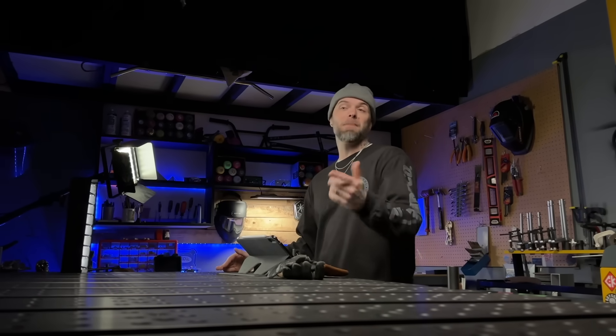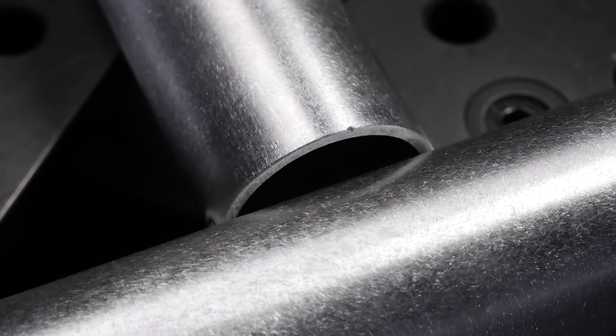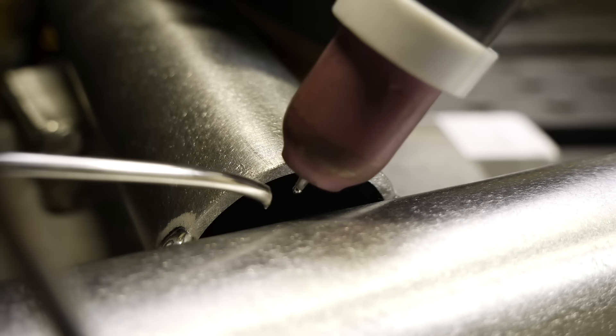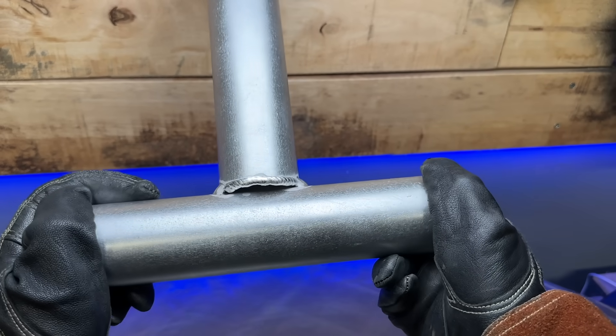I'm going to do something I've always referred to as buttering — a term I learned back in school. It's basically where I use filler and build the surface of something up. I'm lining it up on this edge right here. It's going to take a few passes, but the goal is to build this edge of the pipe out with good filler material and bridge it to the other pipe. This is kind of like welding on the edge of a knife — the pipe is relatively thin, so I've got to be careful with heat and the amount of filler. I don't want the filler to melt off and roll to the inside of the pipe. I want to butter it so it builds out towards the mating part, just stacking more and more, keeping it relatively flat.